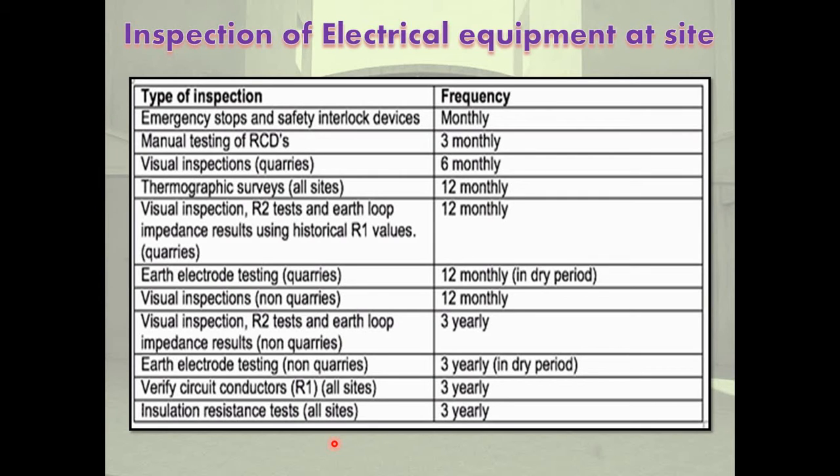Next is information of fragile parts and accessories of the equipment. In some equipment, the accessories are transported in separate packing, but it is not possible in some equipments. For example, if the breather, conservator, etc. or transformer parts are not transported separately with the transformer, there is a possibility of damage to these parts during unloading. CT and PT are filled with oil, so it becomes necessary that the article remains in vertical position.